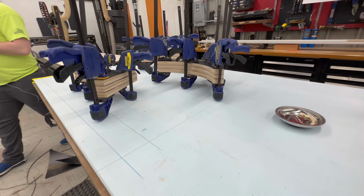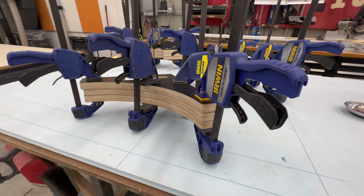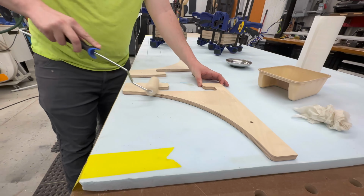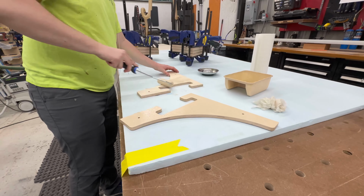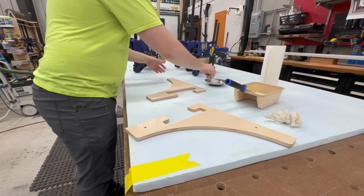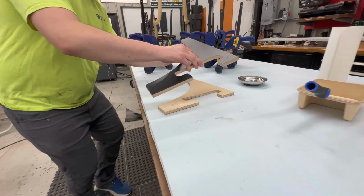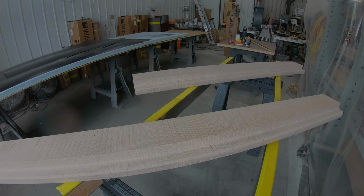And so there's some of them glued up. That's actually 3 different brackets that are 2-ply, so that's like 6 layers together. This is just a close-up of the assembly. We'd put a thin layer of glue on them, and then you can see he's just grabbing those short little dowels, putting them in the holes, and using that to line them up. So it worked really well.